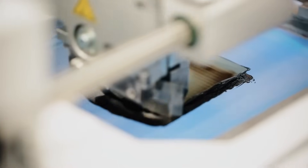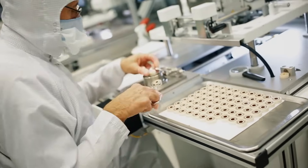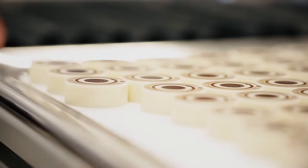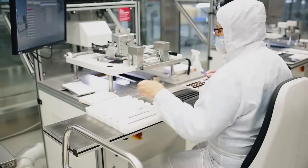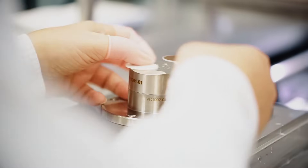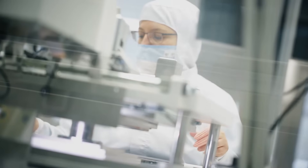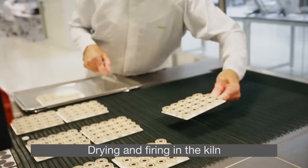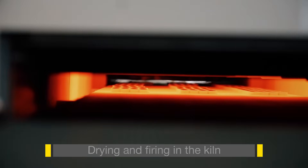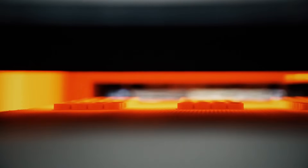On these screen printing machines, a gold paste is applied to the diaphragms and the base bodies. The printed parts are then dried in the special oven. After the drying process, the base body and diaphragm are fired in a continuous furnace between about 600 to 1000 degrees Celsius.